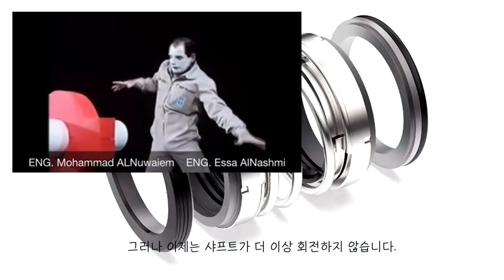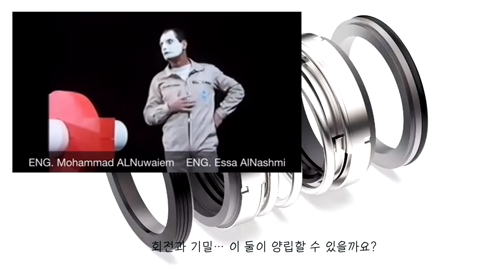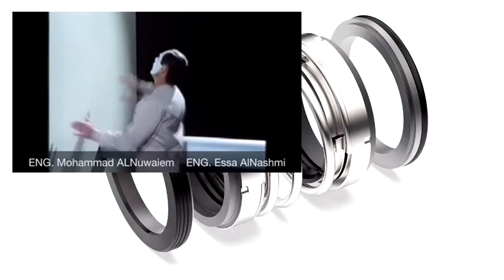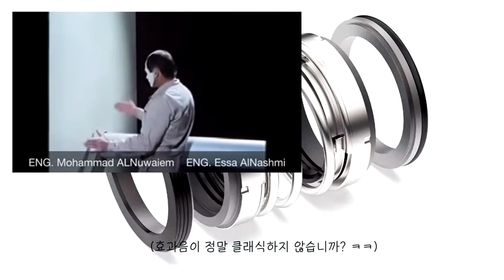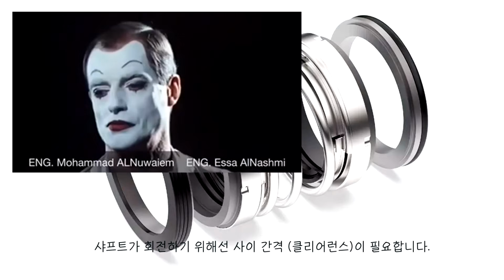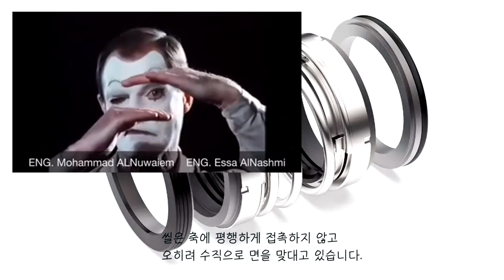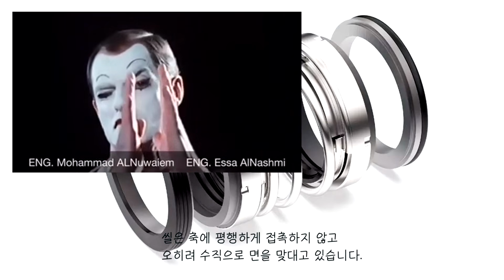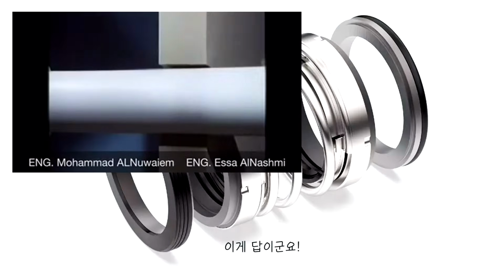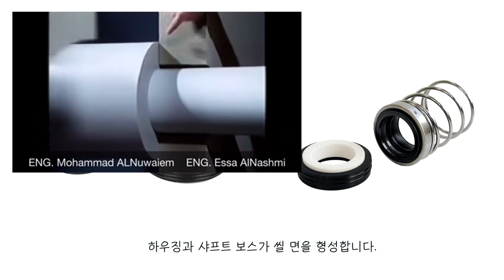But now the shaft will no longer turn. Rotation and sealing. Can they ever be compatible? Here, the shaft requires clearance so that it can rotate. Seal faces not parallel with, but rather perpendicular to the axis. That's the answer. The housing and the shaft boss form the seal faces.